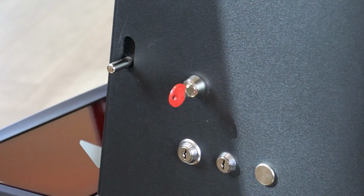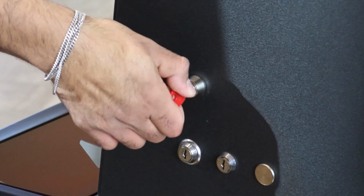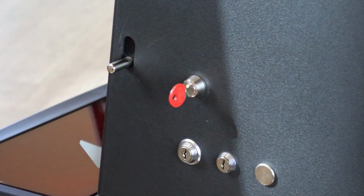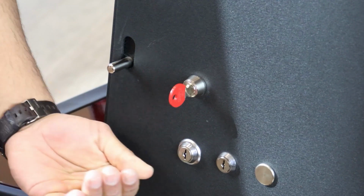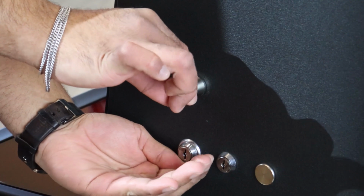Once you have fully inserted the change key, turn the key clockwise a full 90 degrees and return it back to the original position. Before pulling out the change key, place one hand under the keyway to catch the gold-colored master wafer that has been extracted and will fall out of the notch at the bottom of the key.